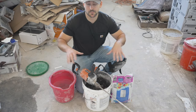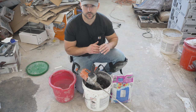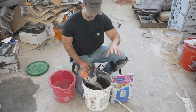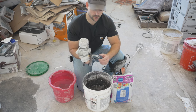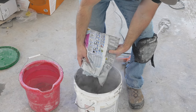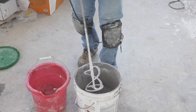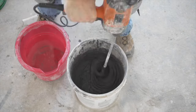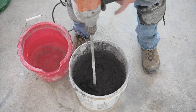Now I'm going to mix up the grout. Choose your grout color and whether it's sanded or unsanded — for regular tile use sanded grout, but for mosaic or glass tile use unsanded. You need an empty five-gallon bucket, a half-inch drill with a mixing blade, and a clean bucket of water. Always wear a respirator when mixing. Pour in however much grout you need — for 200 square feet, at least half a bag. Add a little water, mix, keep adding water until you get a peanut-butter-like consistency, let sit five minutes, then remix.